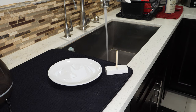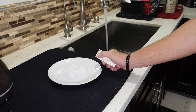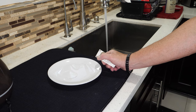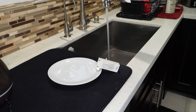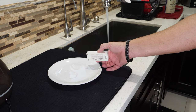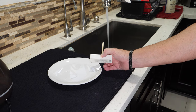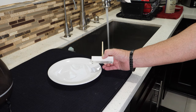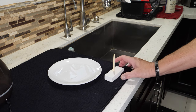To give you a better idea of how the sensors work and how the water gets shut off, I'm going to set up a little demo. I put a small amount of water into a plate. The sensors have two small electrodes sticking out of the bottom, and when water shorts across those two sensors, it trips the valve. I'm going to dip this into the small plate of water, and you can see in real time how long it takes to actually shut off the water. As you can see, the water is starting to slow down and eventually just shuts off completely.